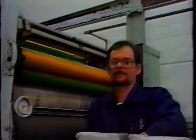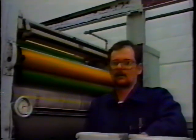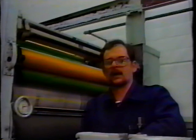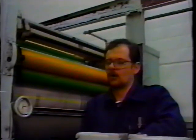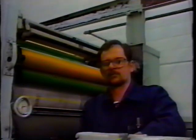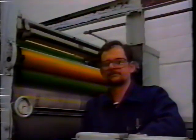Would you advocate the setting of the 4 corners of the rollers on particularly tight jobs in web applications? I think it's probably a good idea to check it all the way around. You can get an idea if you've got some low spots in your rollers. Most web applications, you're going to have maybe a few bad rollers in there. You can't afford to replace them quite as often as you would like to. So it's a good idea, yes.